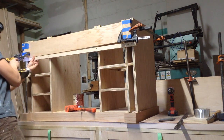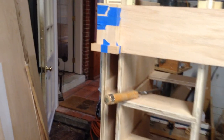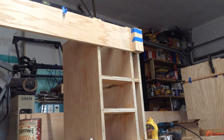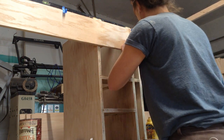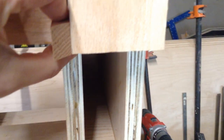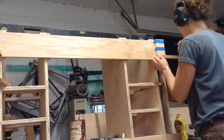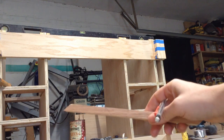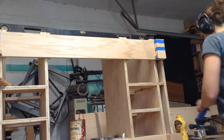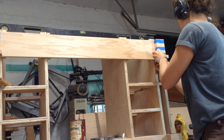I'm removing the bottom right away because the verticals have glue on them — if they drip onto this portion I'll have to chisel it off because it will stick. Here's the trim that's going to wrap around the side. I'm showing you one side done as a visual to explain what's happening with the other side. This is just leftover scrap oak, trimmed to about five-eighths of an inch by about an inch thick. I cut a 45 — pretty simple stuff trimming around a piece. I cut the 45s, measure to one side, cut the other 45, and work my way around. I cut a bunch of these red oak strips for the two sides and then tape everything and work my way around.